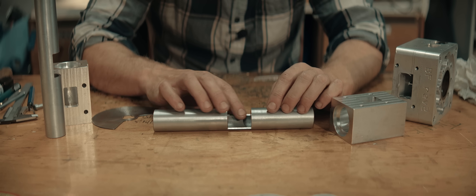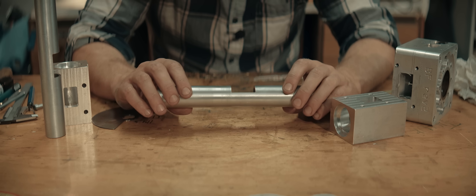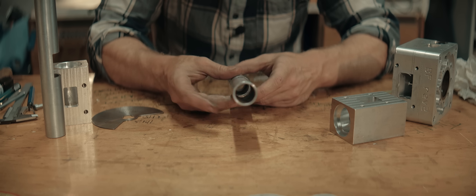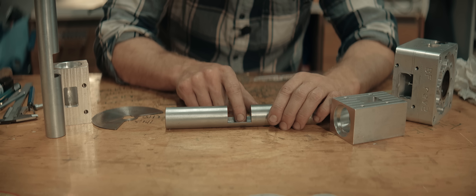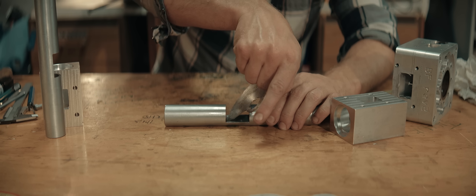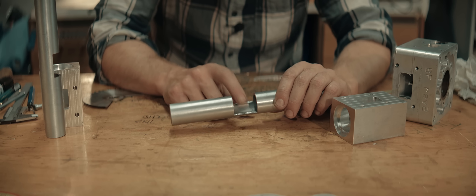The reason I've gone for a combined drum valve and exhaust pipe is that if I had made a drum valve with the outlet on the other side of the valve, I would need two cutouts — when this side is open, this side is closed and vice versa. This won't be the best for flow, but I could machine something with a divider in the middle. Imagine two of those — that would make it better. This will work for testing purposes.